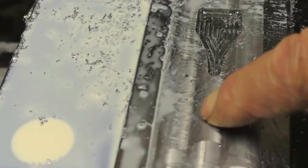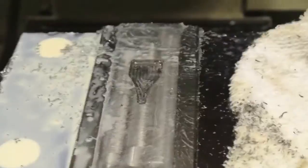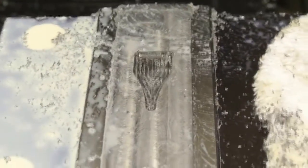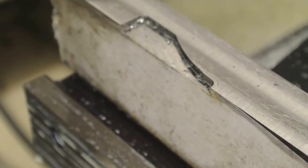The way it grips is I've got two sheets of paper between these two blocks — you can just see the seam down here. Once that's apart, you take the two pieces of paper out, and then when you put your component in, the vise will hopefully grip it just sufficiently. One thing I have to do is check that the part does fit. It may be that I might have to tell lies to the computer — say the cutter is smaller in diameter than it actually is — so it cuts it larger.